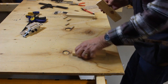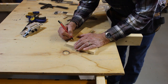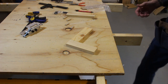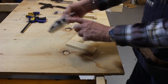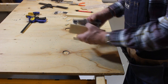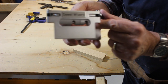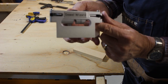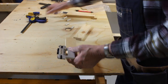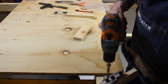So what we're going to do — we're going to pretend we're making a face frame. What we do is make a tick mark about in the center of our joint. It's going to be centered between the two holes we're going to drill. Take the Dowel Wizard — it has a registration mark right there. That black line is a registration mark. We just line that registration mark up with the line we made on our piece of wood, clamp it down, and drill our holes.